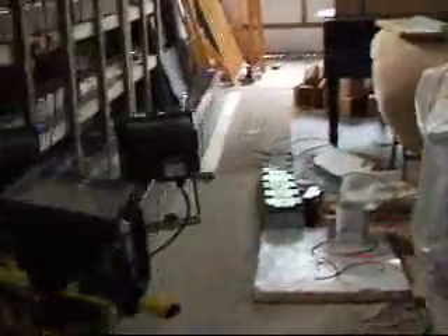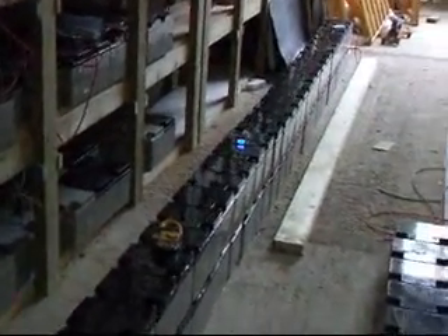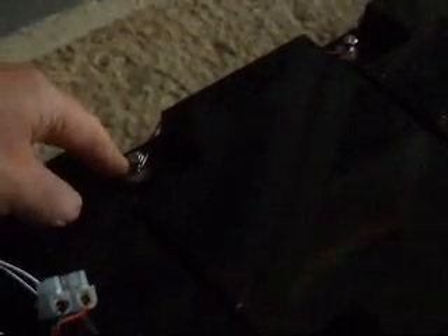Around the corner we're still commissioning batteries. I was able to buy 80 batteries which I saved from going to a scrap heap — they were advertised, and somebody said they'd already sent 80 to the scrap heap. These are arranged in two long lines, one on top of each other. This is a great way of commissioning the batteries: we've simply put the connector bolt into each battery and then run a length of bare wire from one end to the other, hooking it under tension into the bolts.